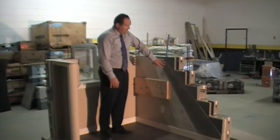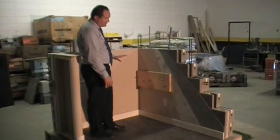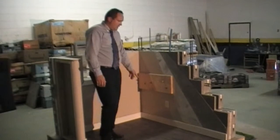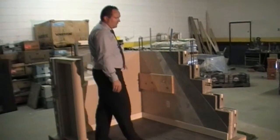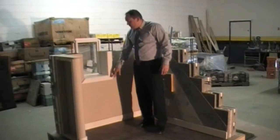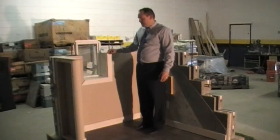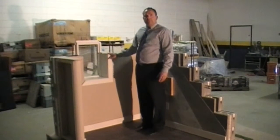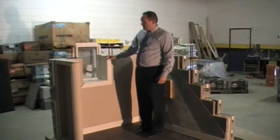That is the complete look and finish of the inside. You can see that molding and trim all around here — everything works together. What we use is some form of PL or liquid nails that actually glues this stuff on, and it holds a lot better and creates a much stronger bond than brad nailing it throughout the home.